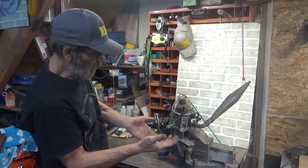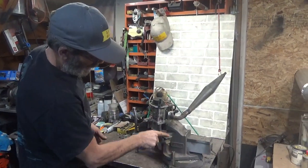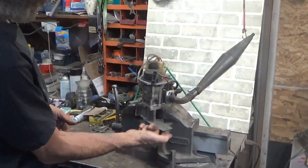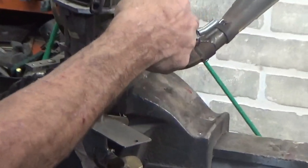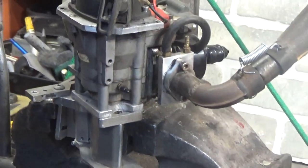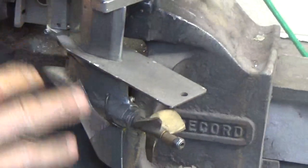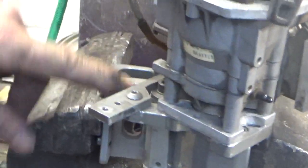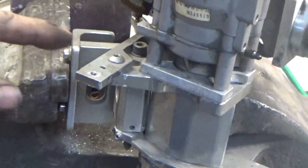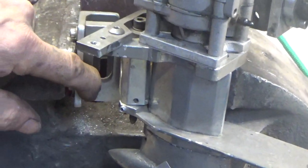So basically the cooling system on it, I had a tube through the plate here, and the prop basically pushed water into the tube, into the cooling, into the jacket, and then spit it out elsewhere. This was all handmade, all this aluminum. You had a trim adjustment. You could move the block up and down. There's actually a pivot in here so you could adjust the trim.